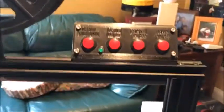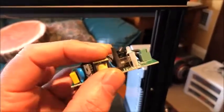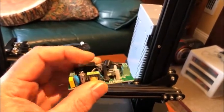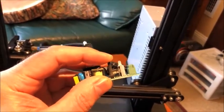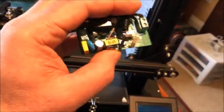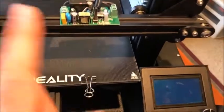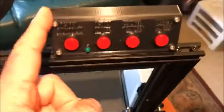The switches are basically tied directly to the switch on the Sonoff devices. This is the replacement Sonoff Basic — a Basic RF, which I didn't need, but it was the same price. When you hold the switch down you put the Sonoff in programming mode, but you can also use the switch to toggle the relay manually. I tapped onto those two contacts of the three Sonoffs inside, and brought the wire through this ribbon cable inside this box, which I also designed and 3D printed.